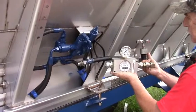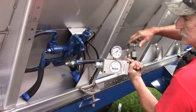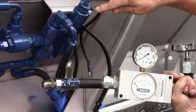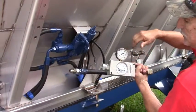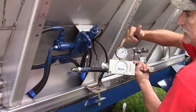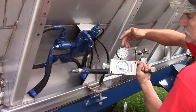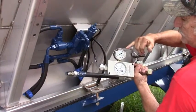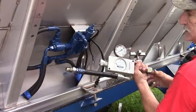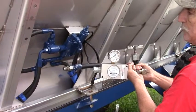While right here at this stage, if you have a needle valve, you can crank the needle valve clockwise. As you go in, you'll see a pressure reading. This is a 2500 PSI pressure relief. Once you run it up, if it pops off at 1400 or 1500 on the conveyor side, you won't be able to spread anything heavy. You need to change the pressure relief to 2500 for the conveyor. If it goes to 23, 24, 25 hundred, then you can go counterclockwise all the way back out — everything is okay. With a flow control valve, you can check everything quicker and almost pinpoint where the problem is, whether at the front or the rear.